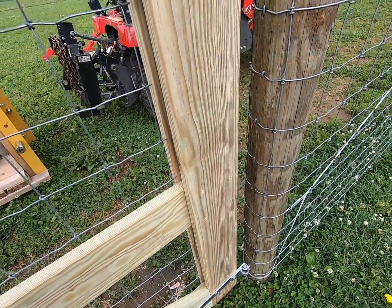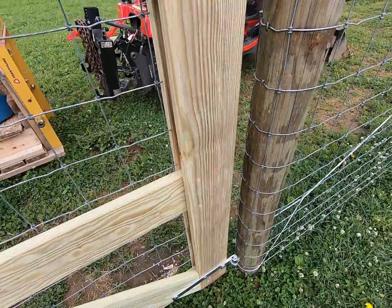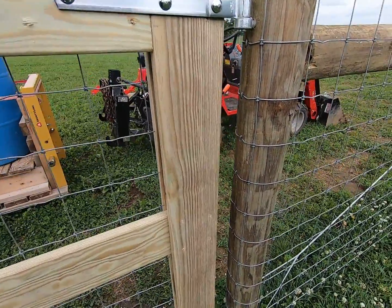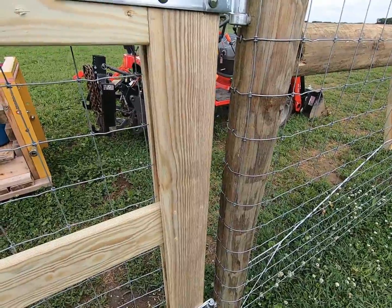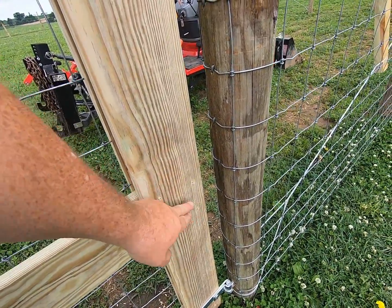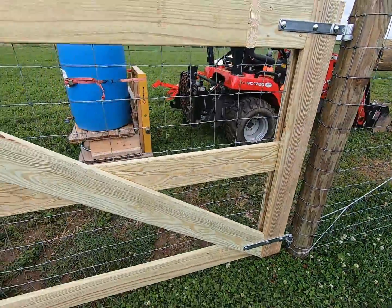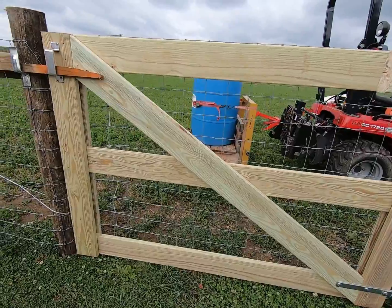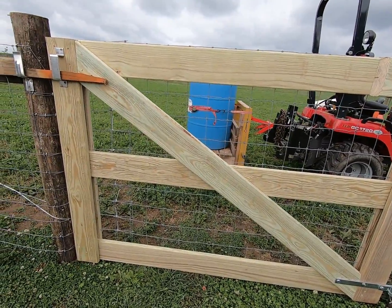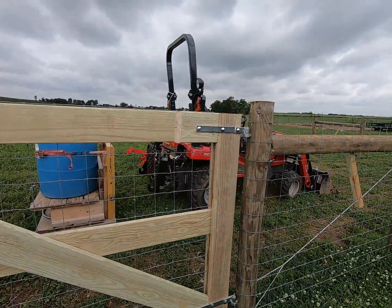And the more I thought about this, this probably could hold a 10-foot with these, because these do come longer. But I don't know, it's just pretty unhandy. These are heavy gates, and you can put a 3rd hinge on here in the middle if you had to. They're heavy when you first build them, but they do lighten up because the pressure treated lumber does dry out quite a bit. So I don't look for any sagging in these, especially with those hinges.